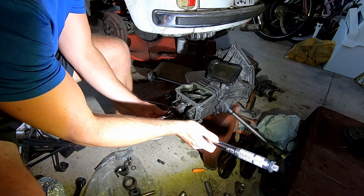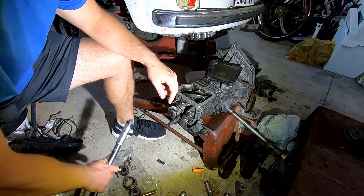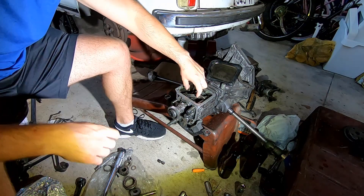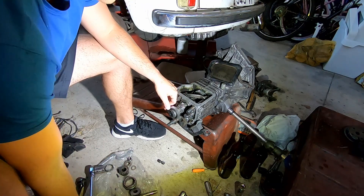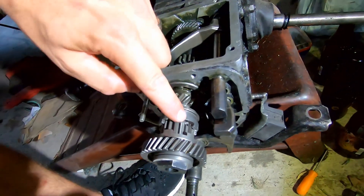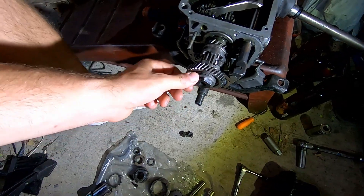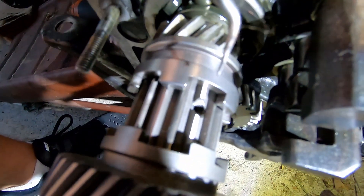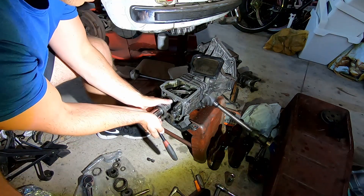The way that you tighten this down is you have to engage two gears at once by moving these things and selecting gears to engage two gears in here at once. You might have to fiddle with it for a while, but you'll get it. Once you do that, there is a hole right there - that's where a set screw is going to go. Once this is tightened down, take something - I used a little scribe tip type thing - and scratched right in there. After you've done that, take it back off.